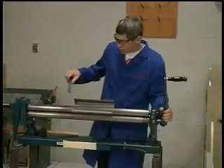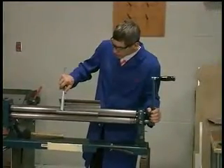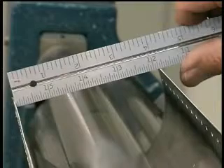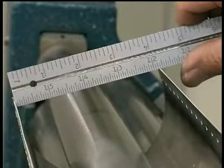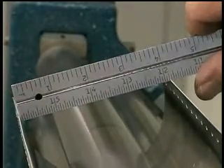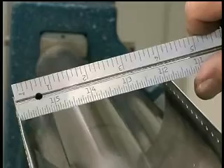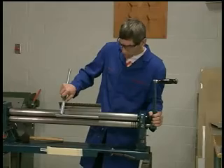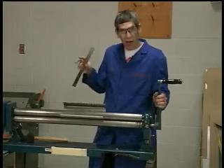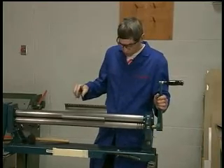Roll it up so you can see — when I measure from leading edge to leading edge, I have about four inches. If you can get it to four inches, below four and a quarter, you've done fairly well. You've got it about as tight as you can roll it. The additional half inch you just have to form with your fingers.